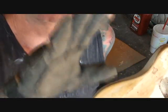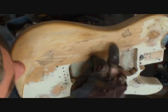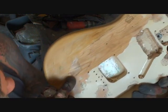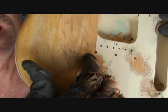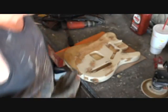I'm wearing gloves because that heater gets real hot. If you look right in this area here, you're going to see bare wood, but if you look right here, see how that looks like a different layer? That's called a sealer — a type of sealer used on the guitars to seal the grain so when you put your finish on, it doesn't penetrate into the wood. I forgot what they call it, but it has to come off.